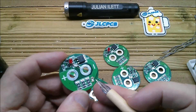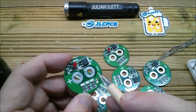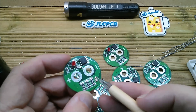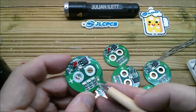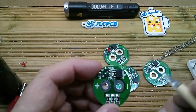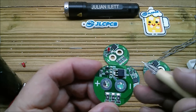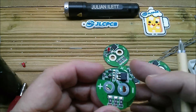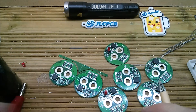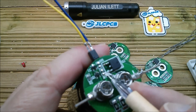I've tried various things. I put a blue LED across these load resistors so when the voltage detection circuit turns on — which is close to 2.5 volts — it dumps energy through these resistors, but that doesn't even light up, so that was no use. I think on this one I put an LED between the two pins of Q2, but that doesn't light either, so there's no point taking that off. I'll leave those on — they're barely visible anyway.